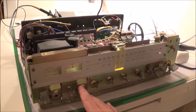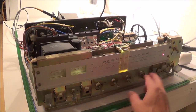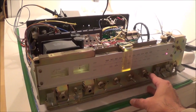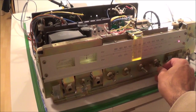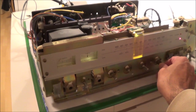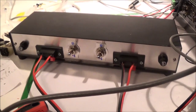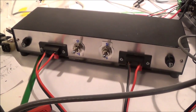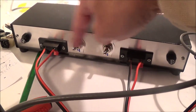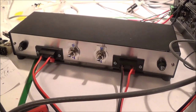The receiver is turned on with the bass and treble controls in the neutral position, the loudness control off, and the stereo/mono selector in the mono position. The volume control is turned all the way up. On the back I have a dummy load hooked up using the 8-ohm position, with both channels connected because I'm going to be taking both channel readings at the same time.